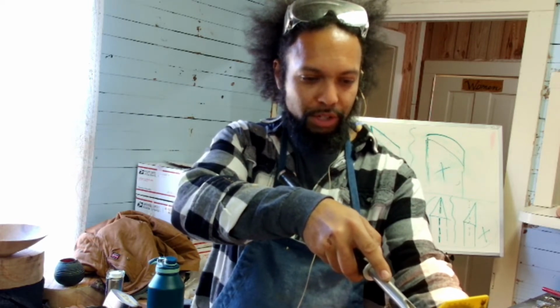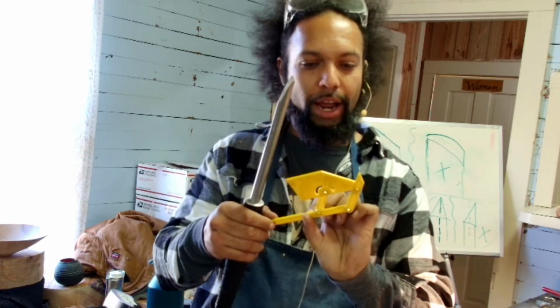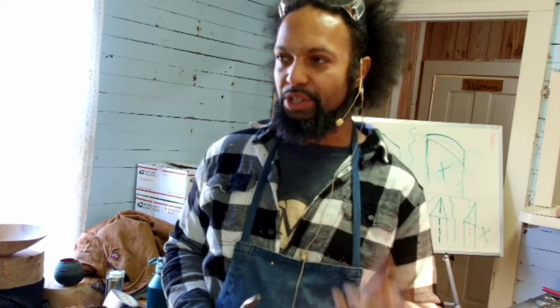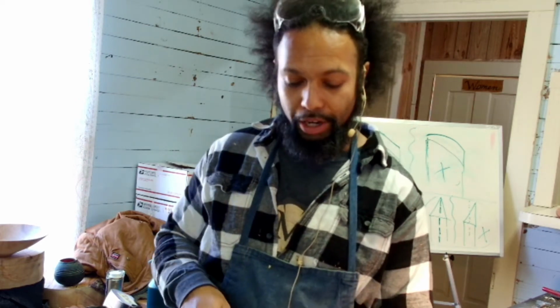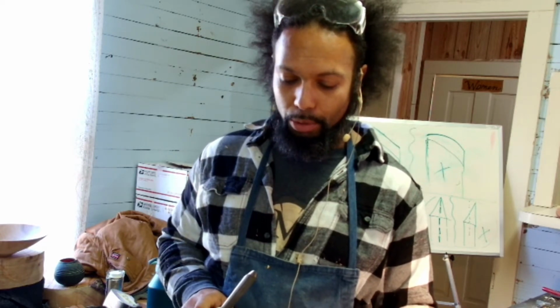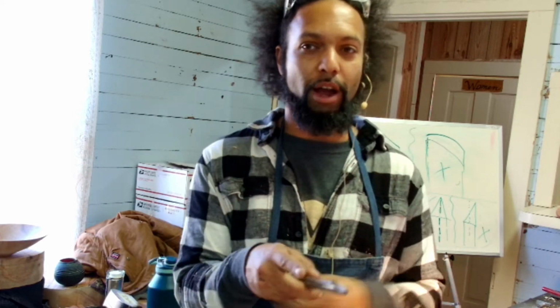So let's see. That's where I'm going to be here. I'm going to read that angle. I set it right there, and that's perfect. That's 55 degrees. So anywhere from about 50 to 60 degrees, if I can make that reading on both sides, then we're in business. I know that that's looking good on both sides. That's great. So when you look over the tool, you shouldn't see those wings ground really inward set.